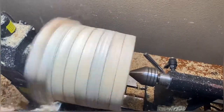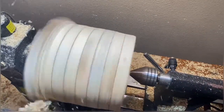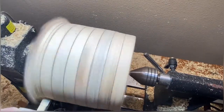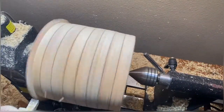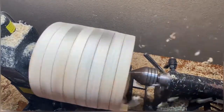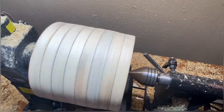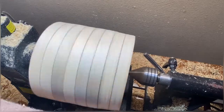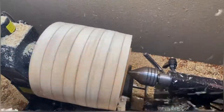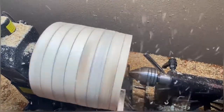I wasn't 100% sure what I wanted to do with this - I had an idea in my head. I'm going to let the video play out for you all to kind of see what it turned into. I didn't really want to do a bowl; I just wanted to do something kind of new that I hadn't tried before. We'll just get the outside all the way trued up and true up one of the faces as best we can. I have this mounted on a face plate right now. You see me carving down the end here - this is going to be for a tenon. We're going to get a tenon on the right side so I can flip it around and put it in a chuck.